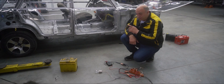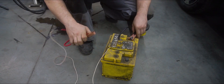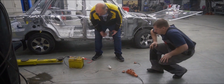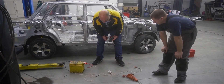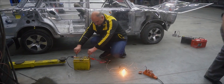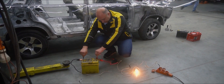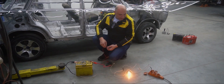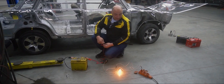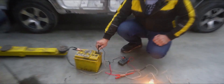Let's connect this to a battery so that we've got something to draw current, and give this another try. We've got negative and positive — looks like we didn't screw this up. Something's happening. Let's take a measurement. It has increased slightly, fluctuating between 13 and 12.5 volts. If it's going up to 13, that tells us it's receiving some charge. Now we just need to measure the current — anywhere from 150 to 200 milliamps. That's what's charging the battery.